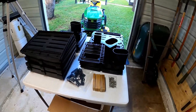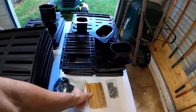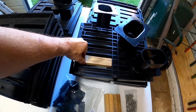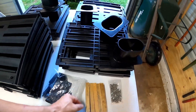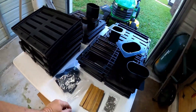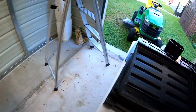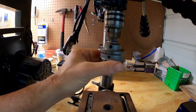The reason that chew-out is in there is so that if it becomes a ghost trap — meaning the buoy gets cut off or you lose the trap — the crab has a chance, a slim chance, but a chance to chew out this wood and get out. That's why they put it in there.